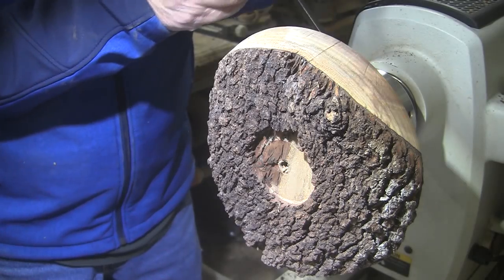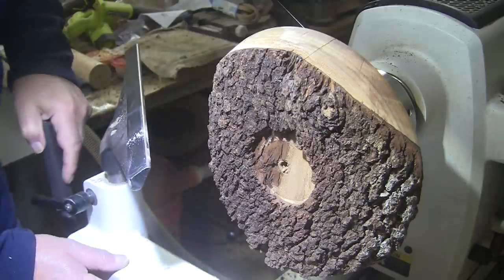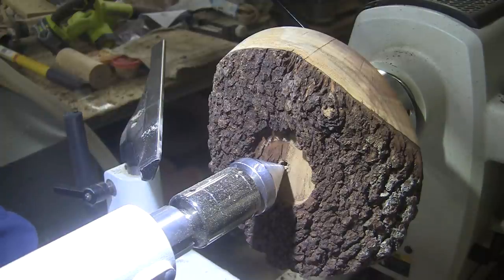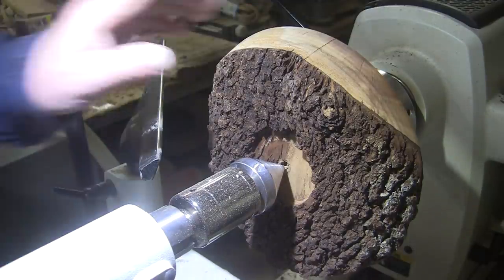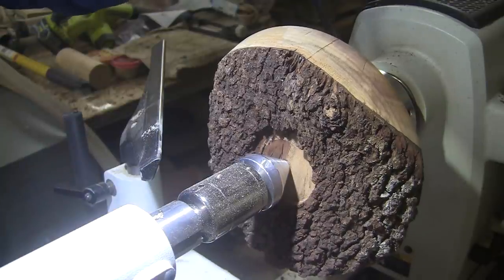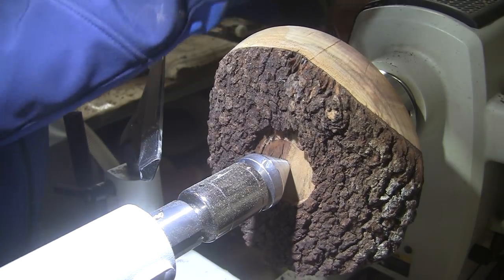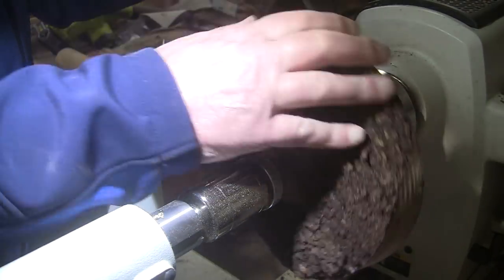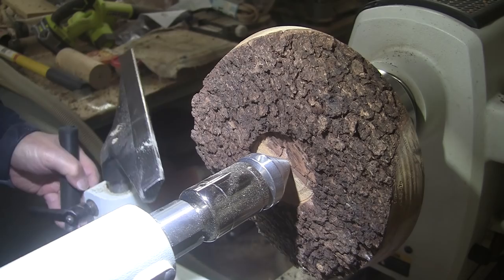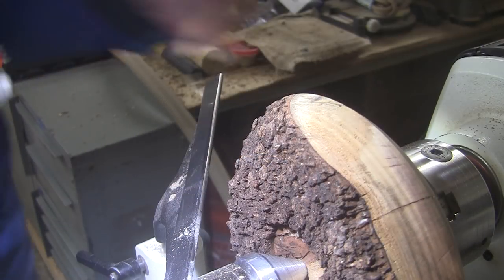I found the best way to do this for me, being an old guy, rather than just push on here with my thumb, I like to bring up the tailstock and drive the live center in there and push the tenon into the chuck jaws and then tighten it up. That way I know that it's well centered and well seated. So all the bark has stuck with us so far. Looks good. Now I can work on my side profile. Here we go, still turning at 1000 RPM.